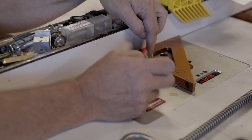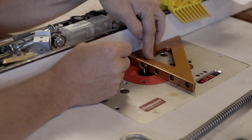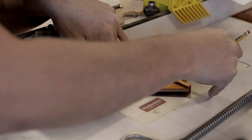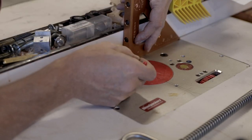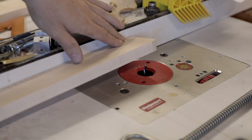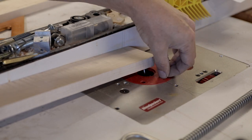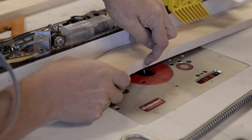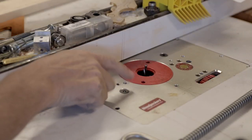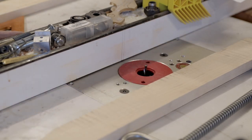If you're going to use a router table to route your truss rod pocket, use a square and line up the leading edge of the bit and then the trailing edge of the bit. We can always stop a little bit short and finish up with a chisel. Essentially, we come past the bit, set it down, pull back to the leading edge line, push it through to the trailing line, pull up, adjust the height, and move on. This is a really nice router lift from Woodpeckers that lets you adjust in thousandths of an inch - a very accurate method versus the hand router I showed earlier.